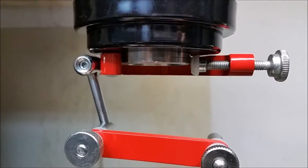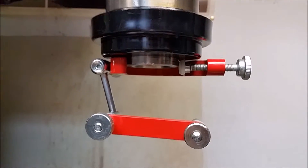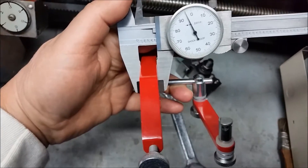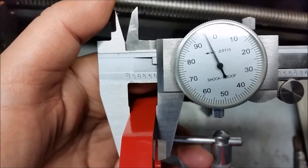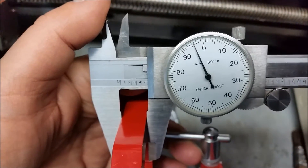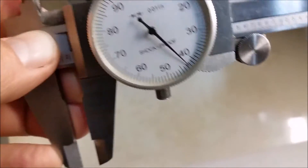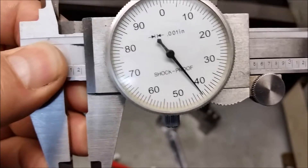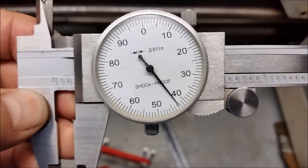That's just not enough to be really effective, so let's get to it. I've measured the thickness of the spindle mount and it's just under 500 thousandths right here. I've got the dial indicator depth section up there and this is what she's measuring - we're at about 242 thousandths.